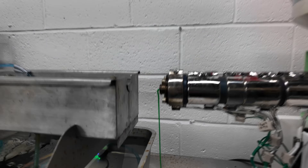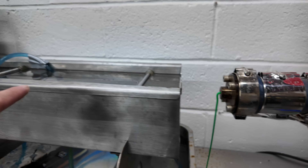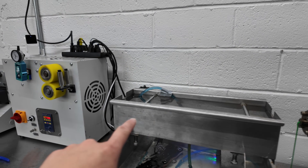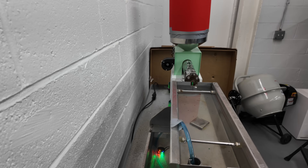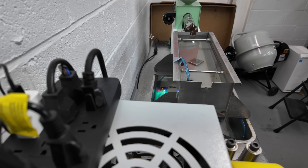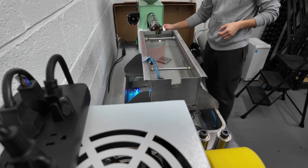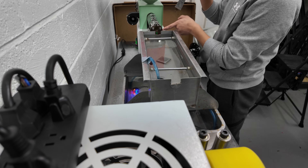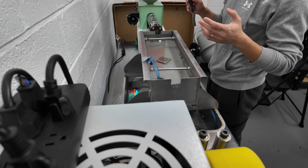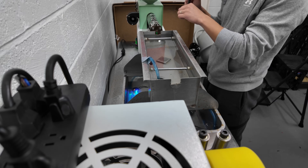Now that we have a nice consistent green color coming out of the extruder, the next part is to get this wound up past the water tank and into the roller. I'm going to set my camera here so you can see what's going on. First, I lower the speed on the extruder down to about 10. This allows me to grab the plastic coming out of the extruder more easily — if it's a slower flow, it's easier to grab. If it's coming out too fast, it's very difficult to pull it across the line.